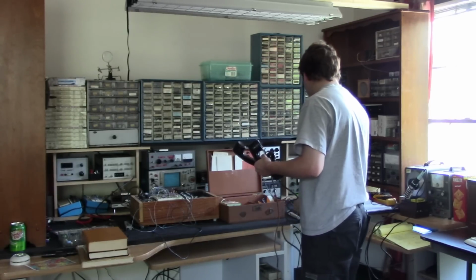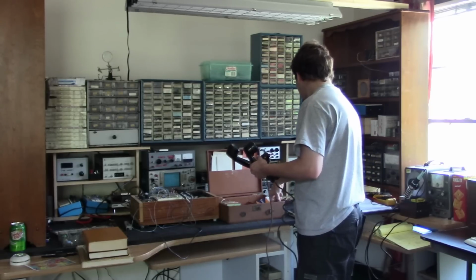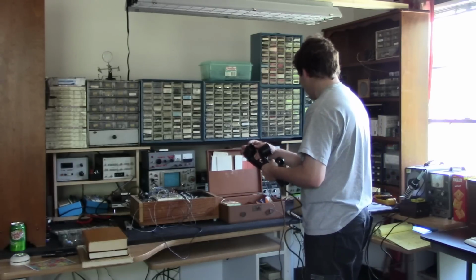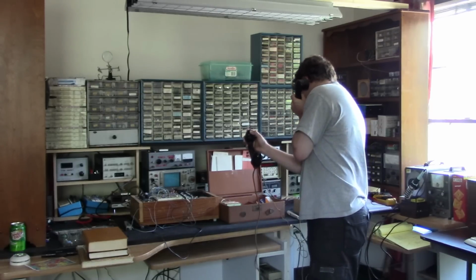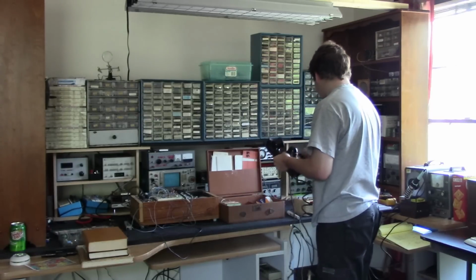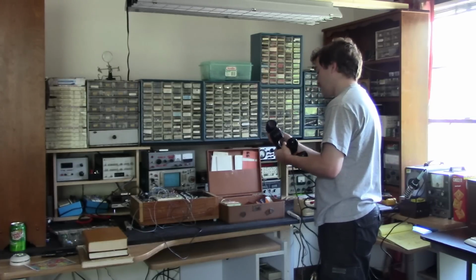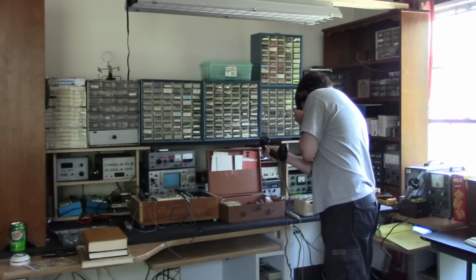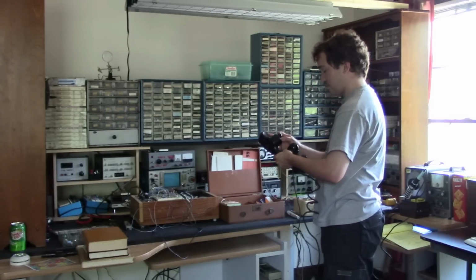I put the machine into record mode with it paused, turn the level all the way up, pick up the coil, and put it up to the earpiece of one. Speak into the other. Hello, hello. I see absolutely no deflection. It does pick up hum. If I put it near the recorder, I can see the level meter respond. Hello, hello. Nothing, huh? Let's try it on this side.